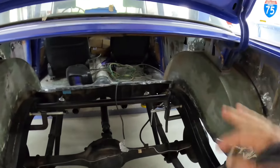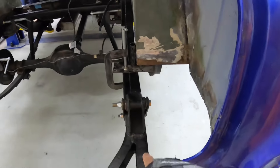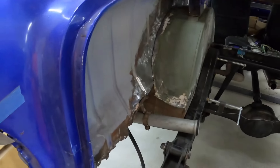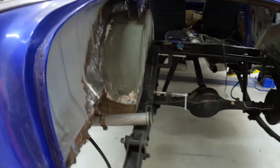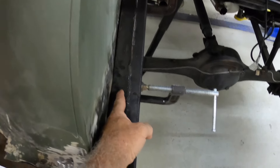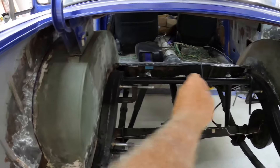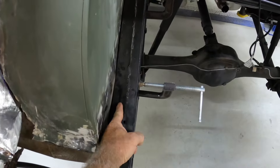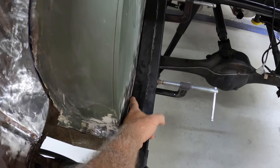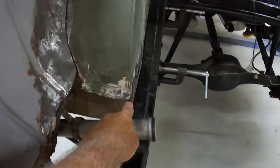So what we've done is measured from each side of the rail - from this rail to that outer rail, it comes up about 41 inches. From the center of this hole to our existing tub is around 18 and an eighth inch on both sides - pretty square actually, but the tubs are still going to move around. It's 41 inches even; we're going to come in one inch, so from half of 41 which is 20 and a half, we'll take an extra inch off and call it 19 and a half inches from the centerline. We'll cut that off because we're going to put the lip back again - we want it to have an original-type lip - and then we're going to cut out this corner here.